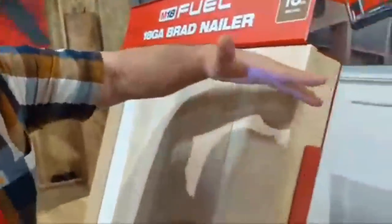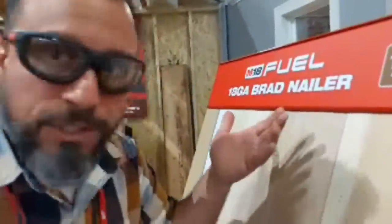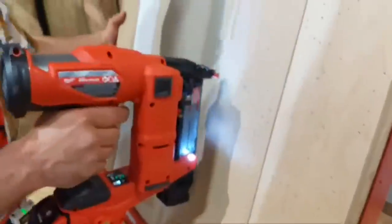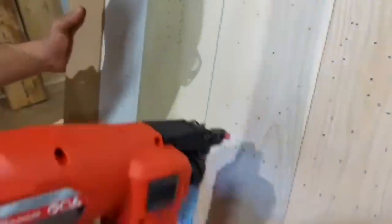You can see, rapid succession. Look, I'll do them right here. Now, I'm gonna hold the back because it will move, so you'll get one that will not be set all the way. But I'm gonna hold the trigger down and we'll do three or four in a row. Keep your eyes peeled. All set perfectly, every shot through the last one. We'll go into the red oak. All set perfectly. Let's go into the soft maple. Perfectly.